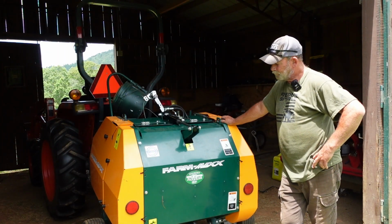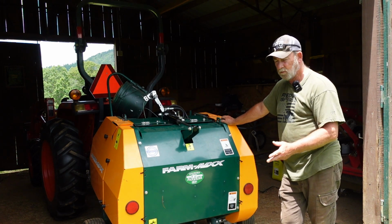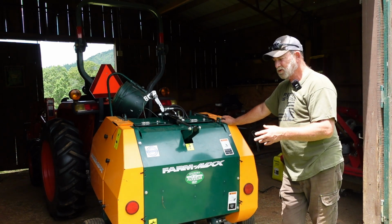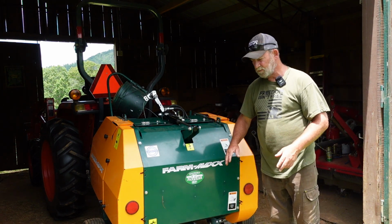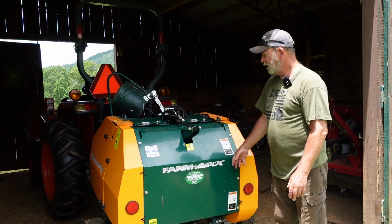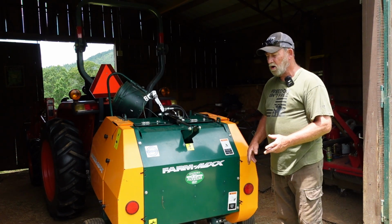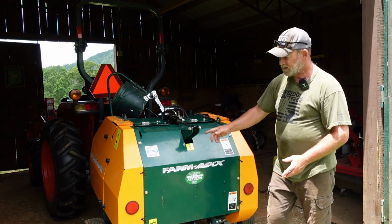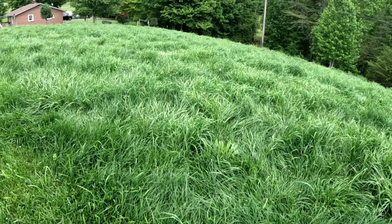Little Baler's done. I'm a huge proponent of being proactive and not reactive. When you see something that needs maintenance on one of these balers, you see hay sticking out these cracks really bad and you just reach there and it just pulls and pulls, that's an indication that it's packed in behind this door skin. Preventive maintenance goes a long, long way, and it's not that difficult to do, especially since I got rid of these tabs. Made this chore a whole lot easier.